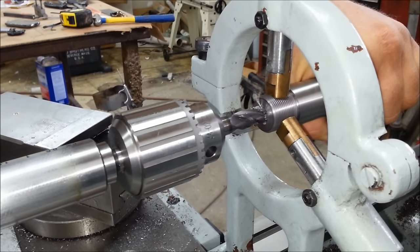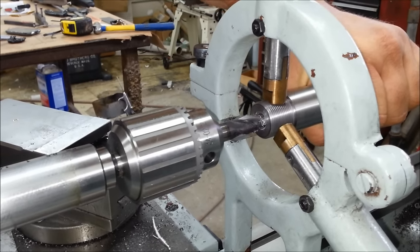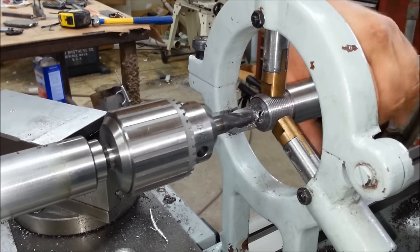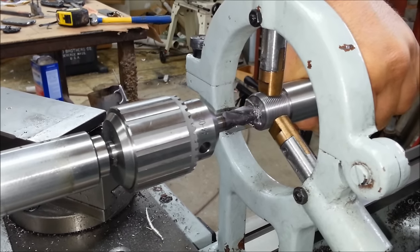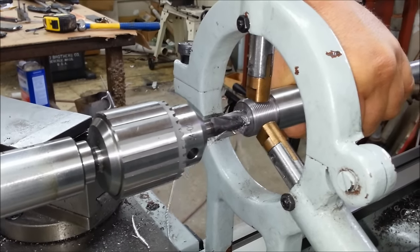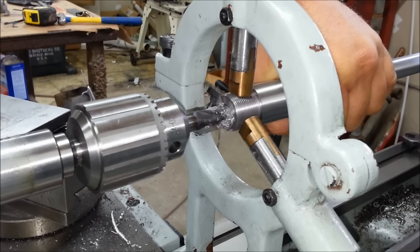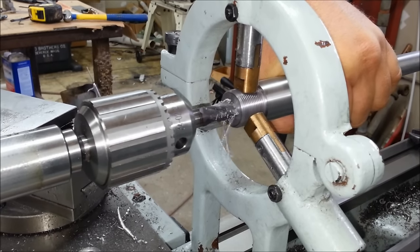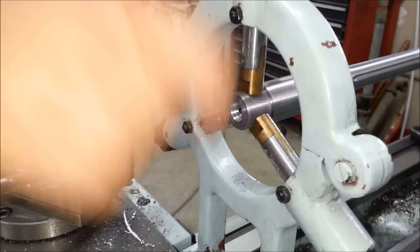Yeah, I know I'm using an end mill. It's not generally the most condoned way of doing this, but it's a real easy way to get a flat-bottomed hole that's a little bit shallow and a little bit undersized. So when I come in with a boring bar, it saves a lot of work. Now there are companies that make actual piloted counterbore cutters to do this. But since I work with so many different types of actions and everything else like that, I figured the money's better spent in other places. That'll get me started.